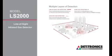But before we dive into the setup, I'd like to briefly introduce you to the different types of gas technologies and where a line-of-sight detector might fit into that scheme. At a high level, we have point detectors, we have acoustic detectors, and we also have line-of-sight detectors. Now you're going to use your line-of-sight detector when you're trying to protect large areas, fence lines, perimeter monitoring, maybe you're shooting through a storage tank area. And because of that, we have two pieces of the system that have to be aligned towards each other.